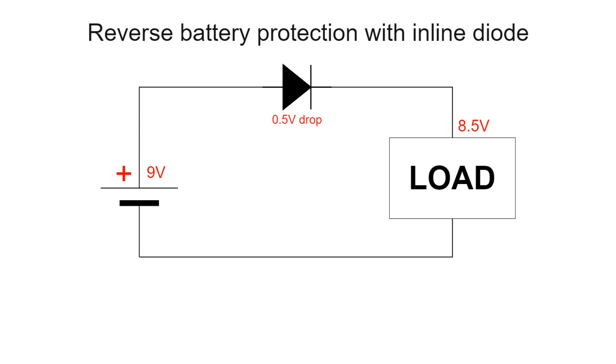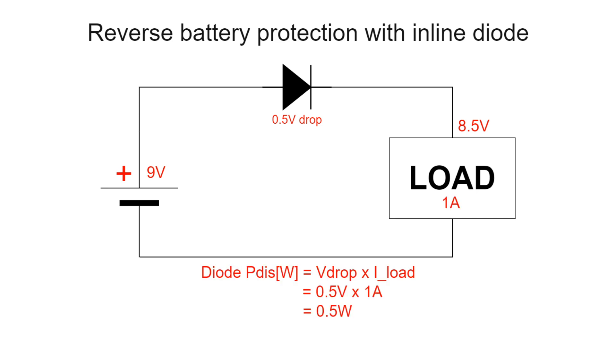Because if we're talking about higher input voltages, battery protection is pretty simple. You can simply add an inline Schottky diode — if the input voltage is reversed, the diode will be reverse biased and it will block the current flow. There is about 0.5V voltage drop on your diode, but if you have something like 9V input into a 5V regulator, there's plenty of margin to afford losing half a volt. There's also the power dissipation to consider — you multiply the current with the voltage drop and you get your power dissipation into the diode. You pick an appropriate diode capable of dissipating that and the problem is solved.